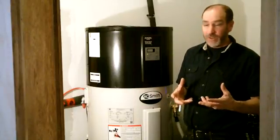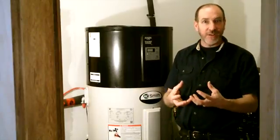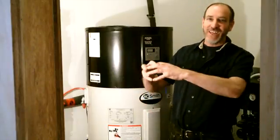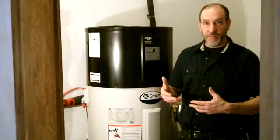What this one does is it takes in the ambient air of the house, condensing it like a heat pump does. Instead of giving you hot air, it's giving you hot water, and the byproduct that comes out is a bit of cold. Not a problem in a mechanical room, and it actually isn't a problem overall. A lot of people worry about that — like, oh, but I'm adding cold to my house. No, that's not what's going on. You're simply taking super efficient air, condensing it into hot water, and there's a little bit of cold left over.